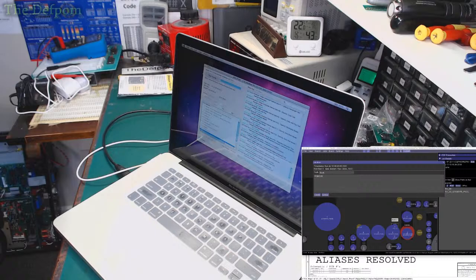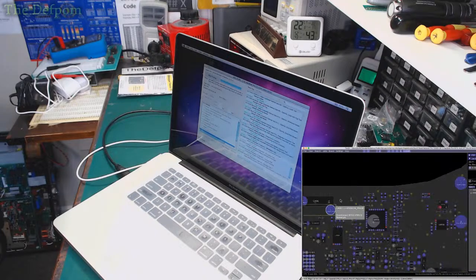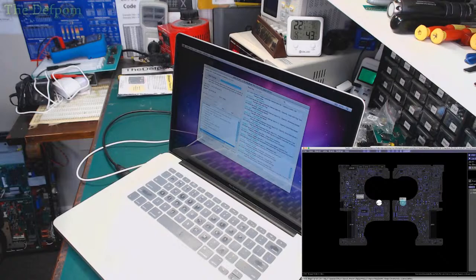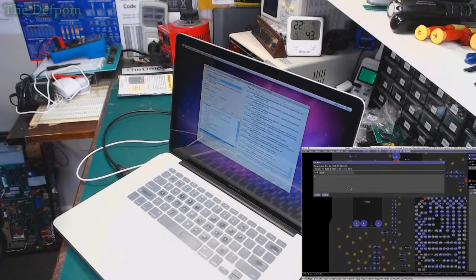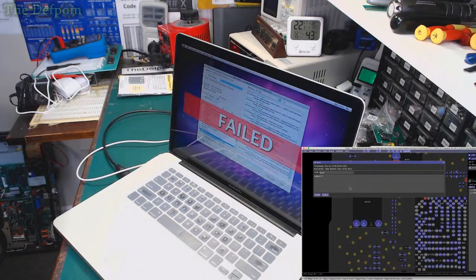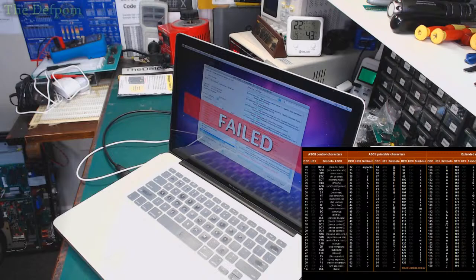Yeah, it's kind of working. So, I've added notes in here. I've clicked on that resistor, done a thing to add a note, removed that part. So that's now gone. And what I should also do is flip it over to the other side, over to here, which is where the SPI ROM is. Add a note to this, a job item. Added Tiresias GPU killer. Done. So that's my notes for that job done. And there we go, ASD's now failed as expected. Cool, so that's that done. Get rid of that. And let's go back to the desk.